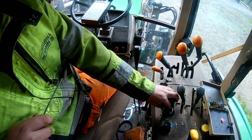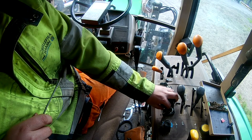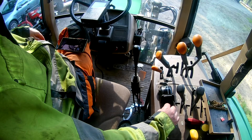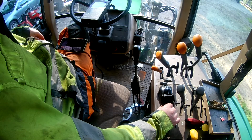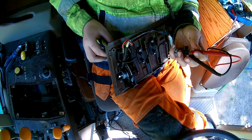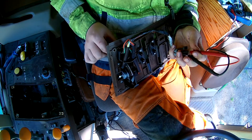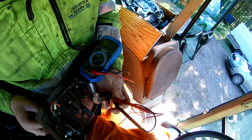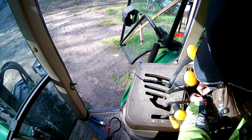With the hoses replaced, I could go back to checking what was up. The two dials at the back that control the maximum lift height and the speed — I could not get any good readings on them and it was beeping at me in some of the modes, which is apparently a bad sign according to the video I found. I disconnected them and measured; both had a smooth transition from low to high resistance, but at the far high end they went up a little and then the last bit they dipped down in resistance slightly.